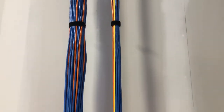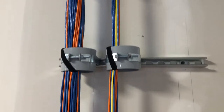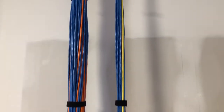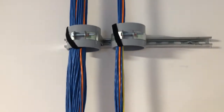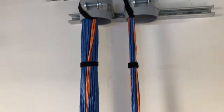Our J-hooks — we're using the CAT-64s. That implies it holds 64 CAT-6 cables. It's a really big J-hook. When you put your J-hooks in, you've got to do it right. That's your piece to keep your cables from flopping out. We'll show you that.